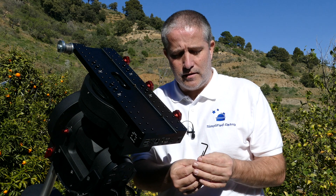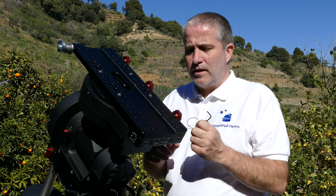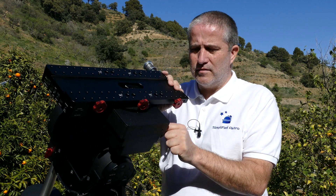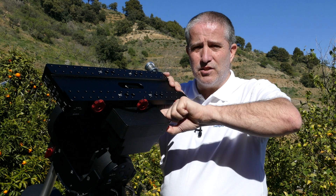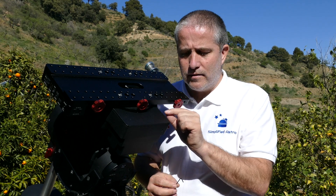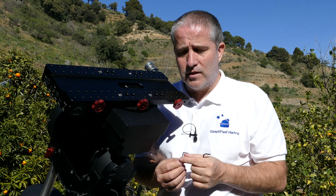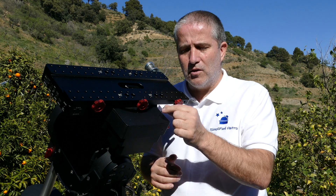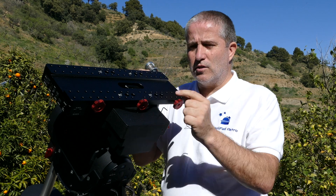The two things we're going to need for this job are a 2mm and a 3mm allen key — that's all. We're going to disengage the dec gear, because this needs to be done with the gear away from the holes to undo the grub screw. You also need to engage the gear, because through the top hole — which is the locking grub screw hole — there's a hole in the pin that goes through. With the gear unlock switch in the unlock position the allen key doesn't fit, so you put it in the lock position, insert your allen key, and unlock that grub screw.